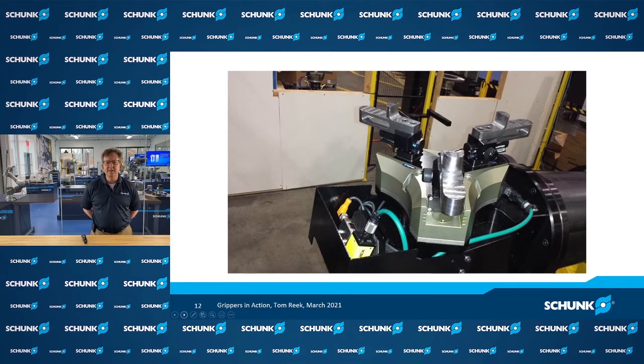With workpieces, you might have a lot of variance in sizes — for example, a range of differently sized parts you want to handle without making complex tooling changes. Shown here is a large three-jaw long-stroke gripper designed to handle a large range of diameter parts. The top tooling on the jaws is designed to be quick-change and adjustable, so for outlier workpieces you can change over or adjust the tooling to accommodate them quickly.